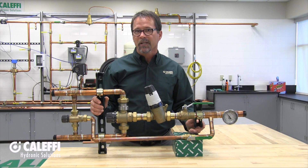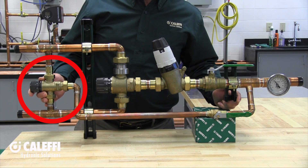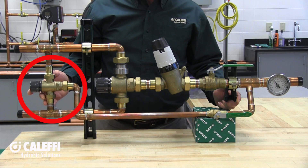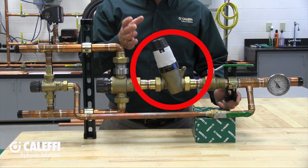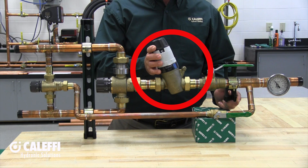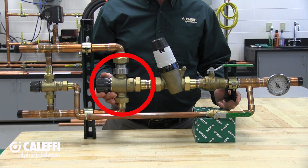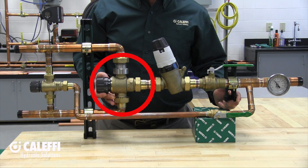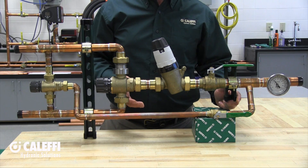Let's take a closer look at the Delta II. This 521 series small thermostatic mixing valve will handle the low flow demands from 1 gpm up to about 8 or 9 gpm. As demand increases, the pressure drop at the outlet of the assembly will cause the 535 series pressure reducing valve to open and then allow flow through this larger 5231 commercial size mixing valve. At that point and above, both of the valves are working in parallel to deliver up to 50 gpm.